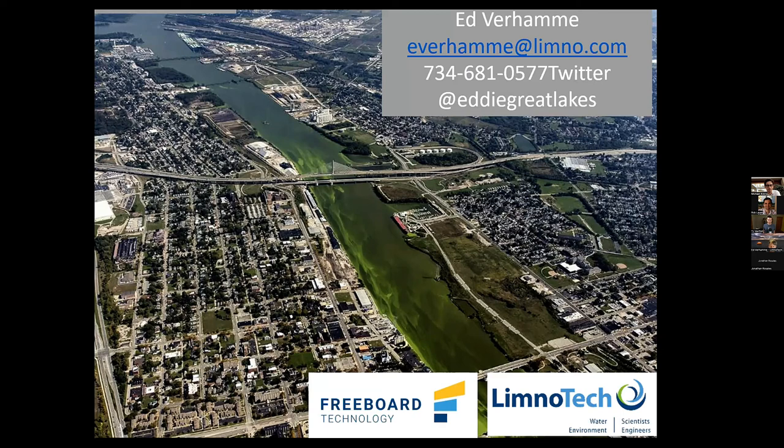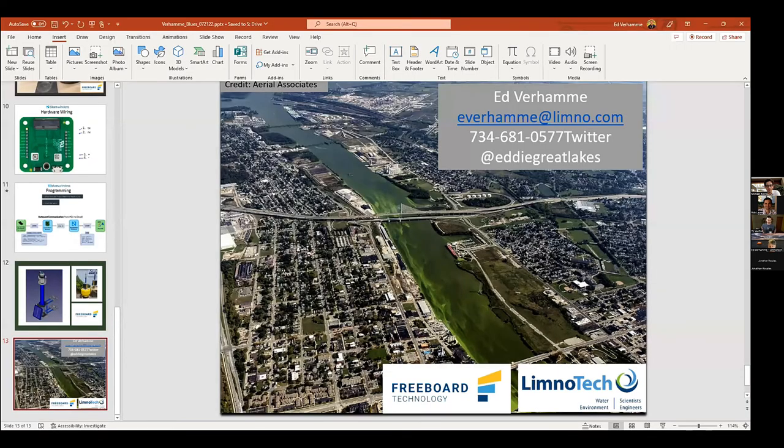We're focused on environmental solutions. If we can use this innovative tech to address a persistent problem of ten years, I've gone into the modules and manuals of cellular modems and upgraded onboard firmwares — and I said I'm never going to do it again. The same goes for LoRaWAN. Once you get to this simple approach, you're really just trying to figure out: what's the data you want to send to the internet? If that's LoRaWAN, great — there's a little module that can just drop in and throw your two measurements to the internet without worrying about the overhead of the custom telemetry system connection. That's a lot of handshakes and overhead that scientists just don't have to deal with.